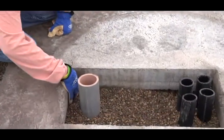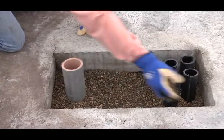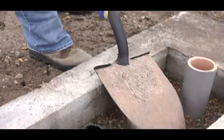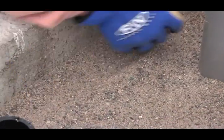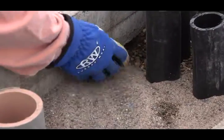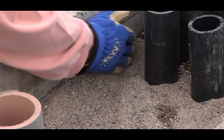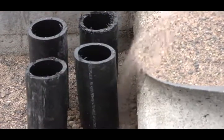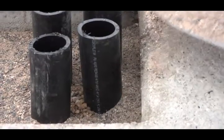Area preparation: after calculating the amount to be used, prepare the target surface area, fill any deep holes or rocky crevices, and cover pea gravel with at least one inch of sand or dirt. Pea gravel that is left uncovered will allow the Instagrout matrix material to filter through, causing a poor seal. Try to make the surface as level as possible. Instagrout's sealant barrier will flow to and fill low spots on the target surface, but it works best on flat areas. Sand is the preferred surface filler for Instagrout.